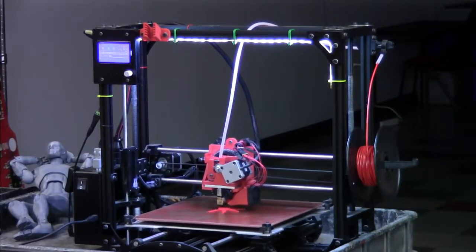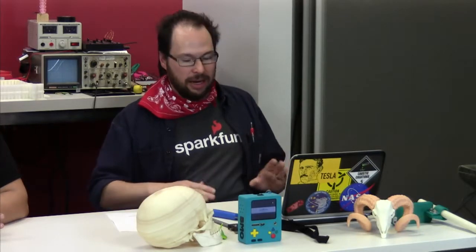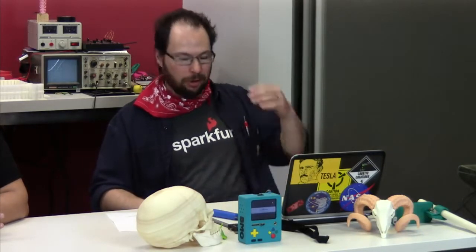Another problem that one could run into is loss of power. If you have a power failure in the middle of your print, there's, again, not much you can do to recover it. So sometimes if that's a major concern for you, you could run your printer on an uninterrupted power supply, or just make sure it's not on a time-sensitive or timered switch. So yeah, you don't want to lose power. You want to make sure that you mitigate anything around your power solution.